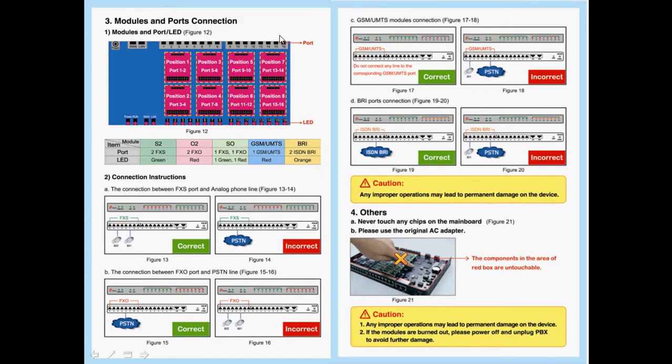All the connections on the back of the system are RJ11. They work on the two middle pins for analogue devices — analogue trunks and analogue extensions. Basic rate connections use the four pins as the four-wire circuits. GSM units simply have a connection to the aerial, which is connected to the back of the casing via pre-drilled holes. A locating nut and washer secure the aerial to the casing, and a small connection is made to the module where you insert the SIM.